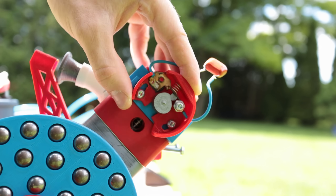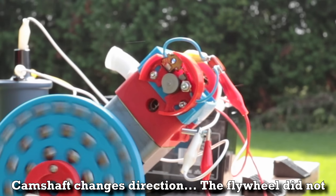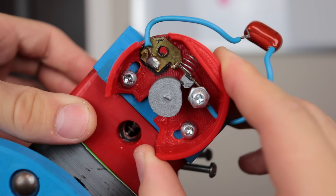This really pains me to admit, but I'm pretty sure one of the biggest reasons why the engine didn't run was because the timing was set way too late — on purpose. When I performed the very first test using just a handheld butane torch, the piston went up and it ignited too soon. Thankfully the JB Weld gave out and let the system continue to move, because otherwise it probably would have been catastrophic. Many people in the comments said ideally I want it 15 degrees before top dead center, which is true for engines that rev high enough, but I decided to play it safe and set it at zero degrees. This guarantees combustion at maximum compression and should also prevent it from going backwards and causing kickback.